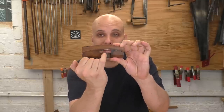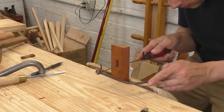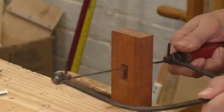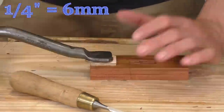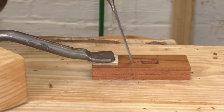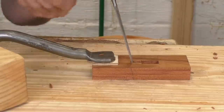This isn't everything you need to know to cut a furniture mortise, but it's a really good start. I bet you'll get it right on the first try. And if you don't, make another one and do it again — it's not a very difficult piece, and you could probably use the practice. Now that we've cut the big mortise, we need to do this little notch right here — that's the part that holds the wedge. This notch is open on one side, and that makes it really easy to chop out. I've got my little mortise laid out, and I'm going to thread a coping saw in there and saw out that inside wall so it can't break out and give me any surprises. I'm using a quarter inch chisel here, and the waste falls into the big mortise, so this thing goes fast. You can see that I have the angle penciled in on the side, and that helps me line up the chisel for the last little bit of paring. Take your time here — you need a smooth slope to that wall, or your wedge won't work.